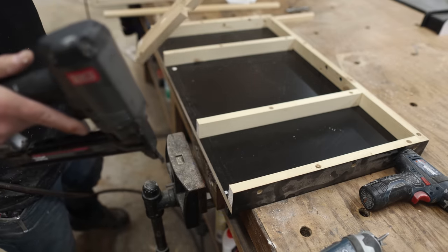I glued and nailed these cedar waves to the back of the door frame I made earlier, and trimmed off the excess at my table saw. I really wanted to carry that cedar look to all sides of the house, so that door was a perfect place to put it. I attached it using stainless steel T-strap hinges and ripped a few strips of cedar to trim everything out. Next, I've got some polycarbonate — it's pretty much like plexiglass but shatterproof. I've used it on plenty of projects before and know how it looks and how to work with it.